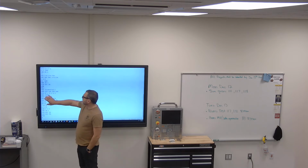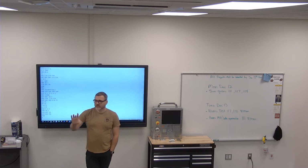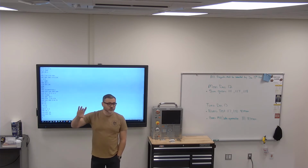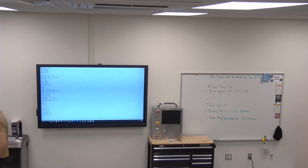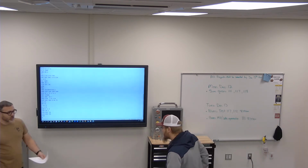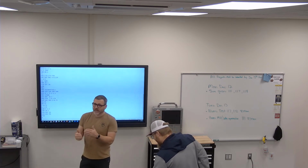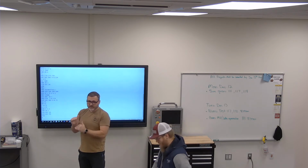If you look from M6 to G43 on the next one, on tool 2, they're the same motions as every single one. Every tool startup starts the same way, and every tool ends roughly the same way. So there's a pattern to all of it, and that's why, when you get into the mode of programming, it's really lather, rinse, repeat. Make the first move, then copy it, copy it, copy it.